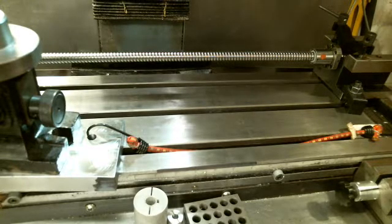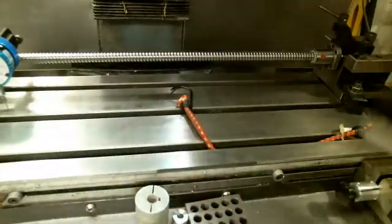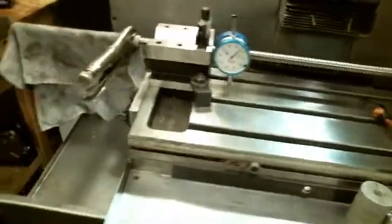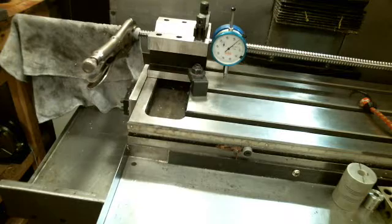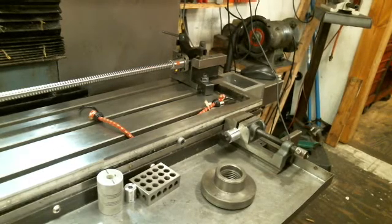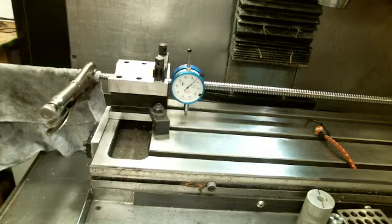I've got to break this up into a couple of videos. I grabbed a ball screw and lined it up on my machine, about the same length as the one underneath this table — actually a little shorter — to represent the length of the ball screw and the motor on the end. If you notice, I've got this end of the ball screw not clamped tight but firmly held in a V-block. The other end is clamped tight, and the V-block is clamped to the table so there can be no motion. All the motion in the ball screw is going to be actual torque — twisting.